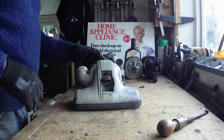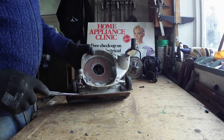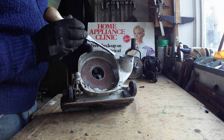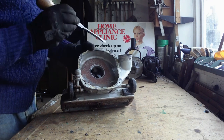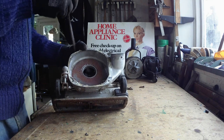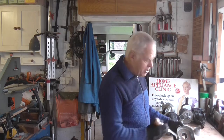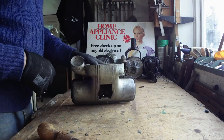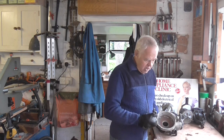On this particular one I've got the front off. What's happened is the two bottom bolts came out, but the top two — that one snapped off leaving a stub, and that one snapped off flush — and it's very difficult now to get those out. You've got soft aluminium and a hard steel bolt; if it were the other way around it would be easy, but because it's this way around it's difficult. There are two ways you can get it out.